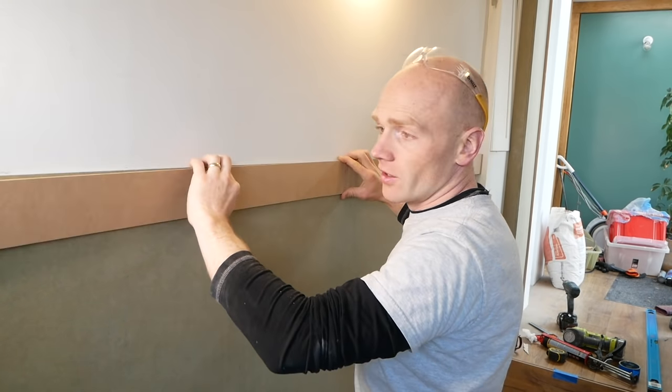The filling of all the holes that happened was just a normal two-part, I think it's the Ronseal one. Again, super quick and easy. I do skim a little bit over these joins, and then you can sand it completely smooth. Right, more answers, hopefully, before people ask. The adhesive I used to put it onto the back is just a multi-six, just a Sikaflex type or Sika product. That is super easy to use and really cheap and easy to find.